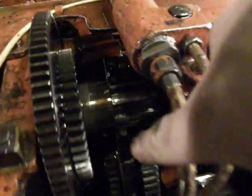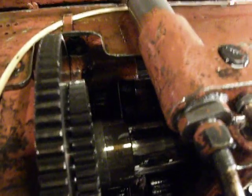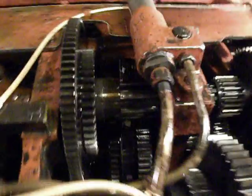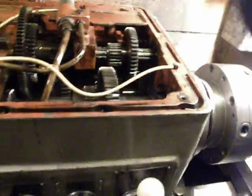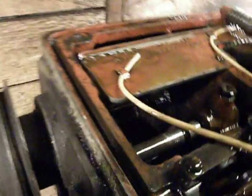Good enough. After the video I will also adjust the brakes. As you can see, there is a belt-style brake on the shaft which spins very fast. Here is a belt-type brake mechanism, and when I move this handle to the neutral position it pulls the brake belt and stops the spindle. Also, almost all of the gearbox is without clutches, but the clutches are still spinning.